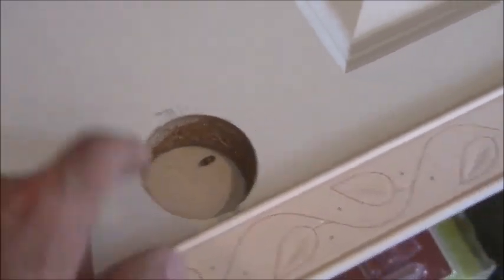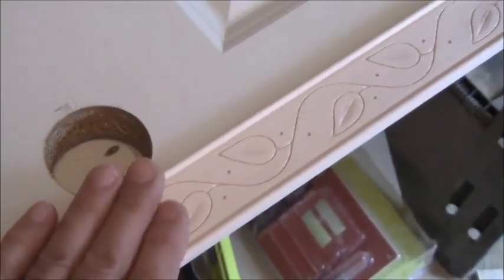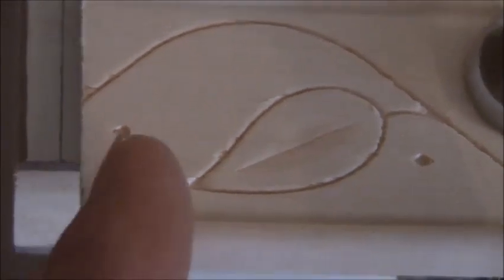And so I've got some glue. I've got it clamped down into place. And I've already done a dry fit with the Lockset, so I know that's not going to interfere. So the placement is good. My line is exposed here with a little bit of spacing. That's how much gap there's going to be between the top of the door and that jamb. So there's enough gap there so that it should not rub or anything.